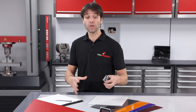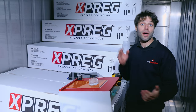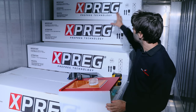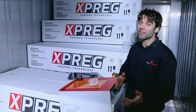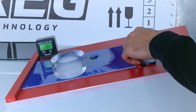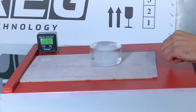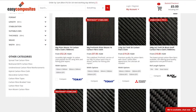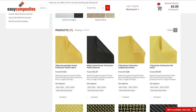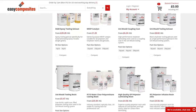To simulate conditions as best we can, we're repeating the entire test using a block of ice in our freezers at minus 25. I'm now in one of our prepreg freezers — for those who don't know, prepreg is a reinforcement with resin pre-impregnated into it that needs to be stored frozen; behind me are rolls of carbon fibre prepreg. It's extremely cold in here, so let's get straight into testing. Although friction against ice increased slightly for the polyester and epoxy gel coats and reduced quite significantly for the polyethylene plastics, the ranked position of each material remained unchanged from the test against steel. A quick reminder that all materials used throughout this tutorial — including Kevlar, Innegra, Dyneema, and carbon reinforcements, as well as gel coats, resins, and additives — are all available from the Easy Composites website.